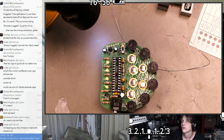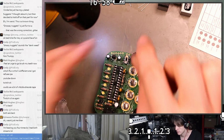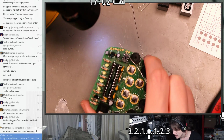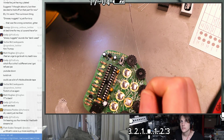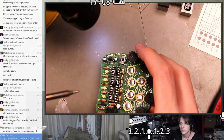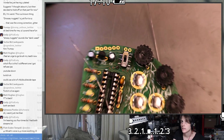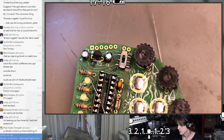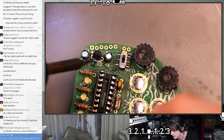Alright, well I think I'm going to go back and do solder balls and not worry too much about the trimming. Just make sure I have enough flux. Since I'm just using the flux that's in the solder here, I'm not adding extra. I think I'm going to end up with something that's easy to clean. Like it might not even need a separate cleaning step. I might take a really quick hit at it with the brush just because I can, but I don't think it needs much.